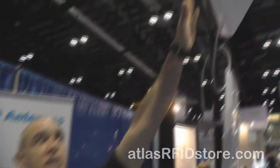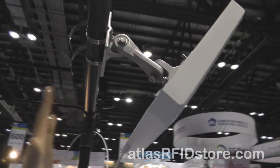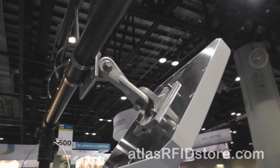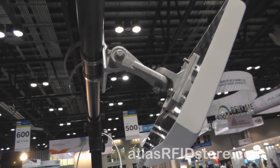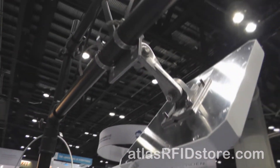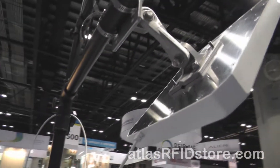On the standard 10 by 10 inch panels we've got a few viable options. We've got the HDMNT — this is a Cushcraft product that's been around a long time. It's a fantastic, economical mount. It does require assembly, which scares some installers off, but if they've used it before they find it's no problem to do a field assembly. It can be used for both wall or mast mounting.